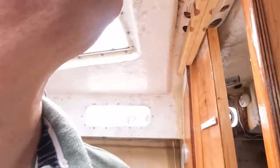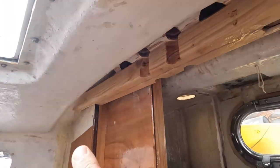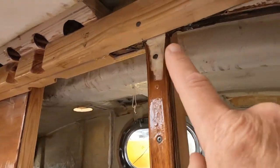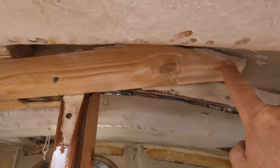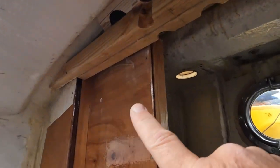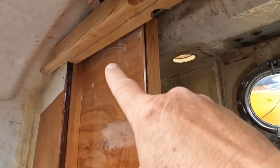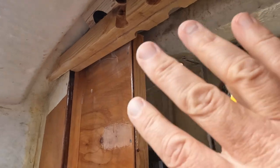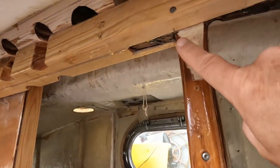It's Thursday the end of June and making huge progress towards being able to get our mizzen mast up. All that beam has been fitted - both beams and the plates with thickened epoxy. I've sanded it, I've just got to acetone it, and then I'm going to put some fiberglass tape to cover all of that area and the same at the far end.